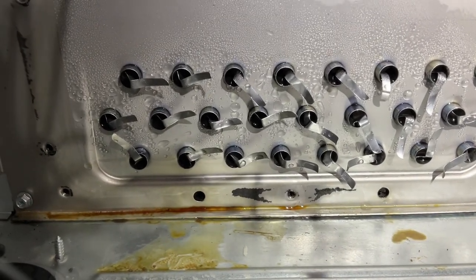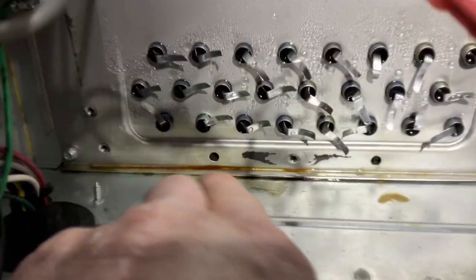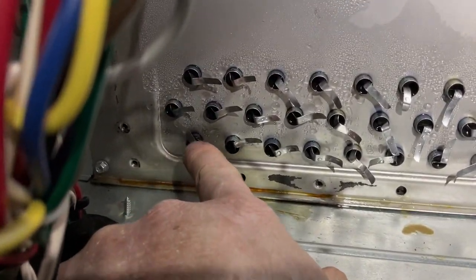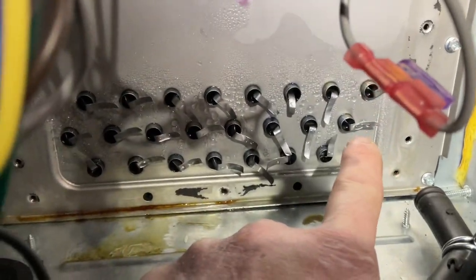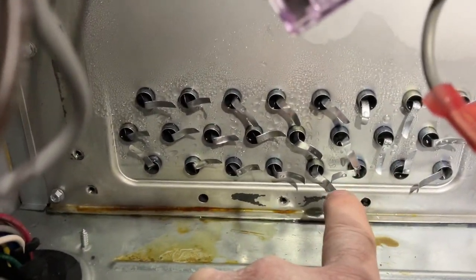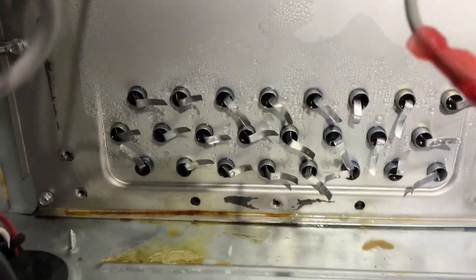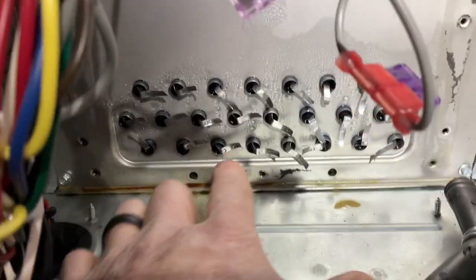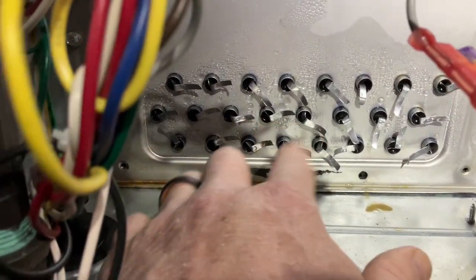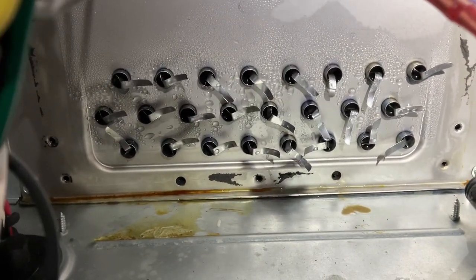Just as I suspected, some of them are turned up, like that one there, these. They are definitely longer. I'm going to have to maybe try to cut them down a little bit. Yeah, this is ridiculous. The water's not flowing down and it's collecting in the draft inducers, it's pulling through. I've had this happen on other furnaces, not Goodman, but other ones.